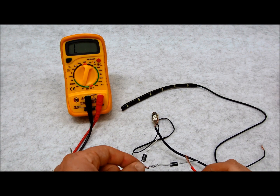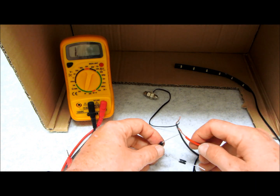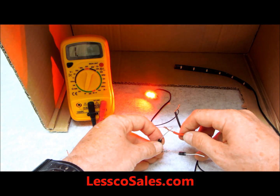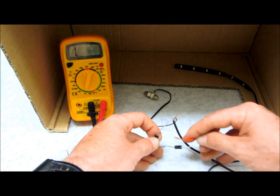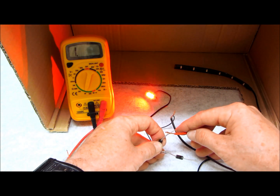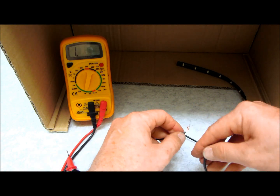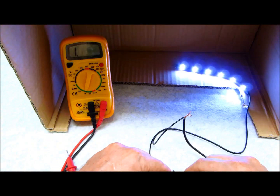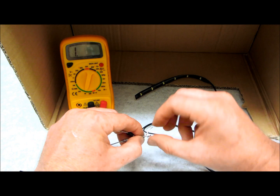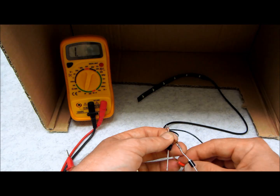Here's what happens — this is so cool. There's our light. When I apply 12 volts to the resistor wire — let me turn the lights off so you can see it a bit better — this wire going through the resistor gives you your running lights or parking lights. And when power gets applied straight into the other wire, there's your brake lights. Running lights, brake — just like that! Isn't that fun? This also applies to LED strip lights. It doesn't matter how many LEDs for the most part because LEDs draw so little current. There's my ground — the strip is grounded — and now I connect it to my little rig: through the resistor, running lights, brake lights.